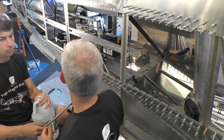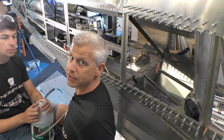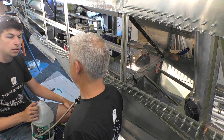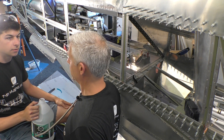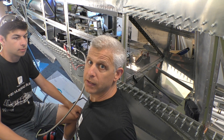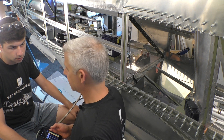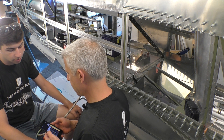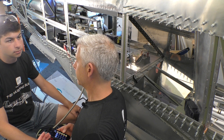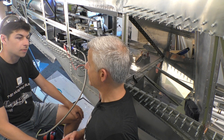I think it started to run dry at the very end because there's a certain amount of unusable that's going to happen, and fluid through lines slows things down really quickly. I think we're going to call it a minute 45 — a minute 45 to a minute 50 — to get that through. So a minute 45 a gallon. That's pretty good, with some good force on it. So I think that's good enough to validate the system, because at a minute 45 a gallon, the entire tank — let's say 16 gallons times a minute 45 — that's 1.75 times 16, which is a 28-minute total transfer. That's not too bad. It'd be nice to be a little bit better but I haven't found a faster pump yet, so we're going to use that as a test and see where we go from there.